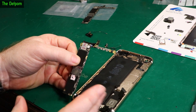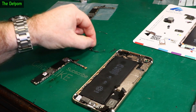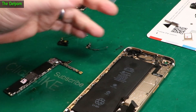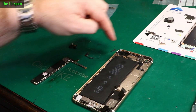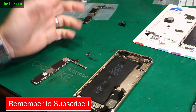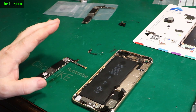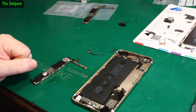Yesterday I went through and replaced these two antennas up here. This antenna here is the original one and I put new, well refurbished ones from AliExpress, thinking maybe it's a bad antenna. I believe this antenna here is the one which actually does the GPS - this one mounts up to the frame. That other one is a different cellular, Wi-Fi, or maybe Bluetooth antenna. I swapped them both, put it back together thinking that would probably solve the problem - but still no GPS.